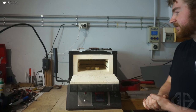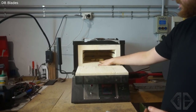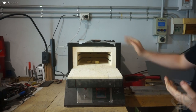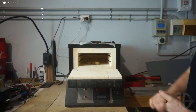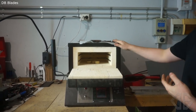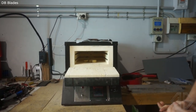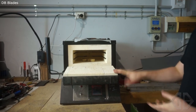I'm sure you could replace the inside of this if need be. You'll see I've got these little ceramic doohickeys — you can get these from a kiln place — and they're really good to keep your stock up off the floor, because I'm trying to protect that insulation. It's really soft and I obviously don't want to damage it; these ovens are not exactly cheap. The insulation is really, really nice — shockingly good actually. I'm doing a lot of stainless steel and on average this oven is running at about 1100 degrees Celsius. That's screaming hot, and it actually doesn't get hot enough up top to burn anything. It'll get warm up top — which is actually why I do my epoxy drying up there — but maybe it's only 10 degrees hotter than room temperature up top, nothing hot enough to be seriously an issue. Really impressive considering how hot this thing gets.